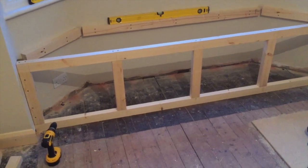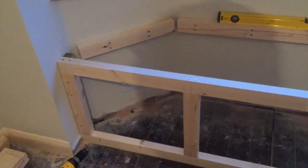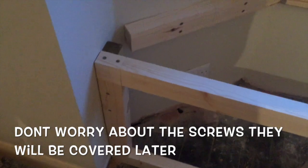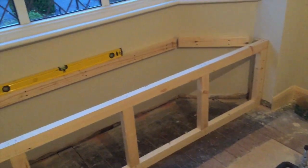Now we've got the front panel on as well. All I did was cut the two pieces to length, cut the five intersection points, measured it all out, and made sure that I'd have the same size doors in between, taking into consideration the extra panel at the end. To attach it to the wall and make life simpler, I had this little bit of two-by-two baton either side, and then just screwed it at the front. Otherwise, trying to get screws through that length of wood and into the wall successfully would have been a nightmare.